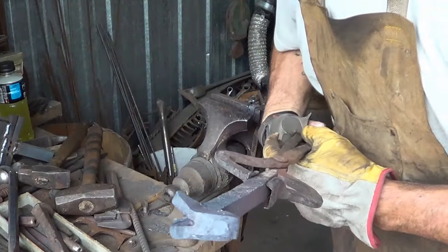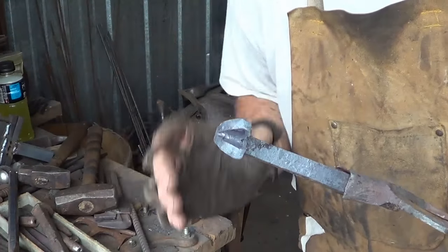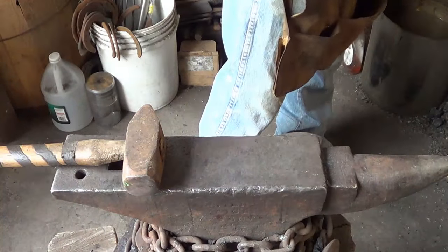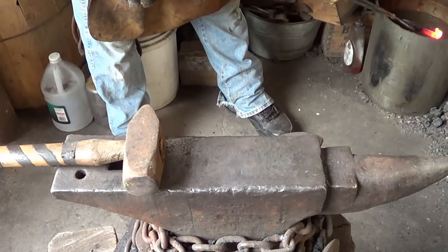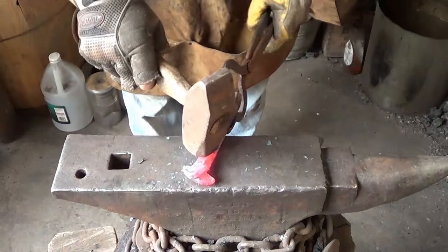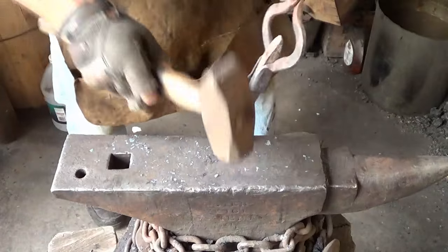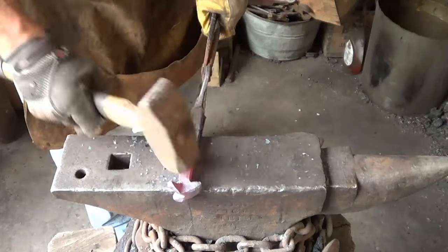So there's the split - very much like the ram's head. What we'll do now is spread those horns apart, put a bit of a shape on them, and then come back and finish the face because I don't like to do the final parts of the horn until I'm done with the heavy heat stuff. Those horns spread apart - very often what I'm going to do is cool this nose down in the quench so that I can use it as a point of hammering. You can go right over the side of the anvil and just give it a couple of hits to start spreading things up. For the bull's head specifically I'll take the peen side of the hammer because bull's horns don't come back like a ram's head - they go out flat.